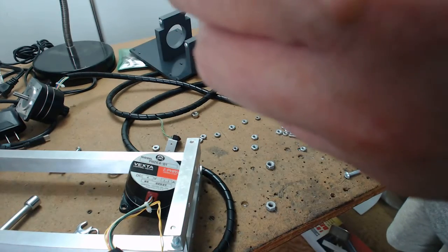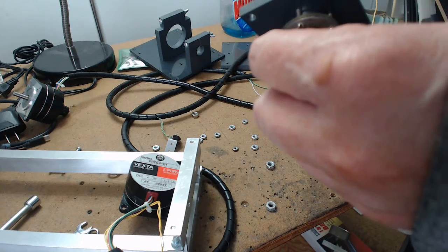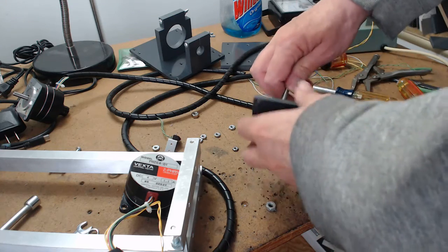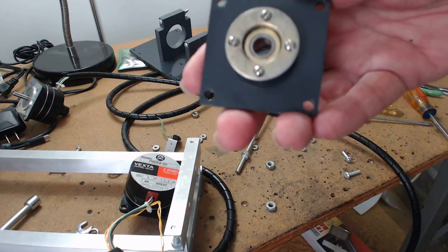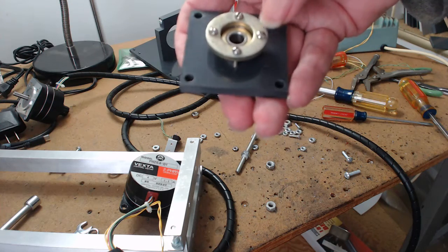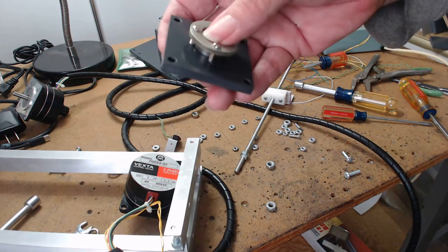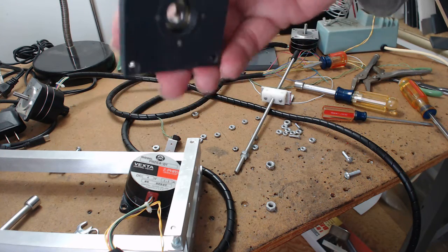And after you get the threaded rod in there, in the machine and lined up, then you tighten the outer nut. You might have to get a vise grips back behind here, or whatever your favorite tool is. But I just wanted to show you that. And now this here is a rollerblade bearing. This is a regular washer with 4 holes drilled in it. Now, when you loosen these 4 bolts, you can move this bearing back and forth a little bit. See, this is what I put in my designs. I make it adjustable, so you can dial a machine in and make it extremely accurate.